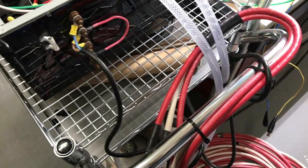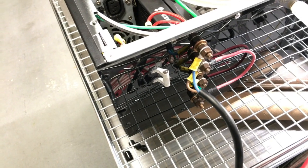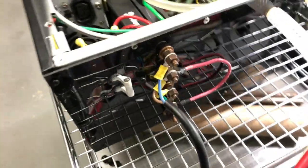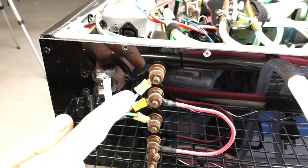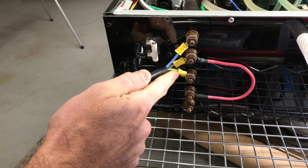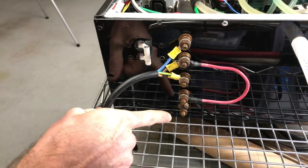To start off with, you've got power coming in. Right now I have this hooked up to 120 volts just because I was testing a noise issue and wanted to divide and conquer, make sure power wasn't my issue. So I've got the 220 volts disconnected right now, but that doesn't really matter. On the back here we've got what is normally two hot lines for the 220 — hot line, hot line, and the ground connection — and this over here is a terminal connection for the pump.